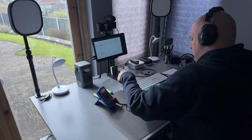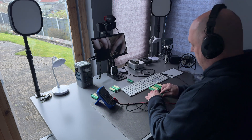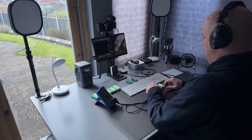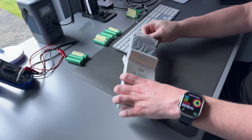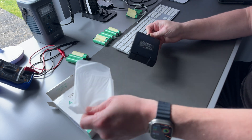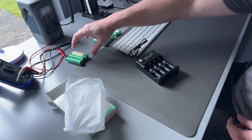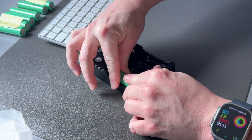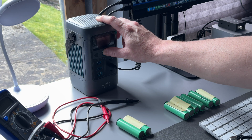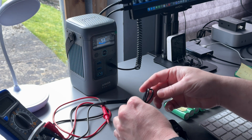These aren't like the originals, however — they have higher capacities, but otherwise they match the same dimensions. Be careful when buying replacement cells, though, because some have a positive end which sticks out beyond the body, which makes them too long to fit in the case. The idea is to use this USB 18650 charger to bring those three batteries up from 3.19 volts to 3.22, by placing them in the charger for a few seconds, measuring the voltage, and then putting them back in until they reach 3.22. It's a bit fiddly, but it was only $4.99 from Amazon, and that's been the only expense so far.